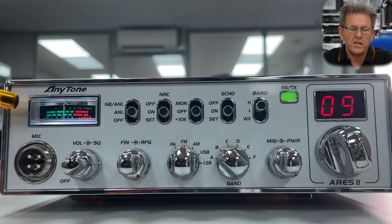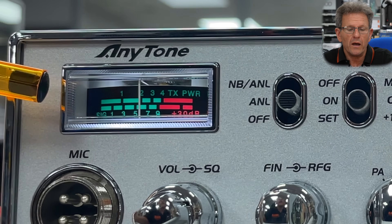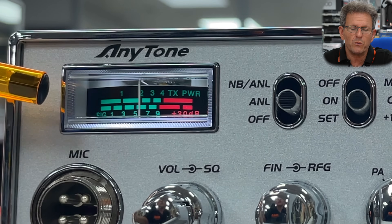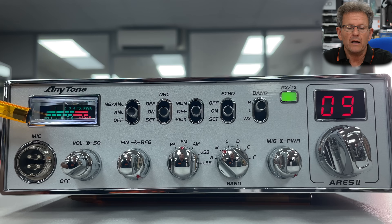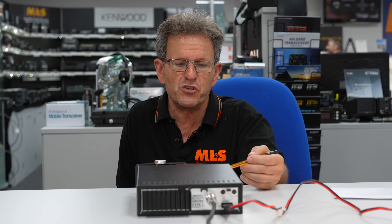The first item is your meter — a nice analog meter. It will give you your approximate power output, the strength of the reception, and also the SWR of your antenna. Not to be taken too literally, but it's a good indicator and you'll know if your antenna is in tune or not.